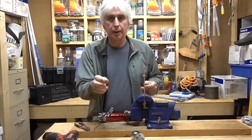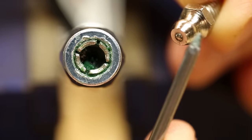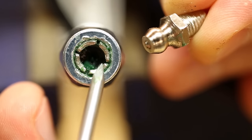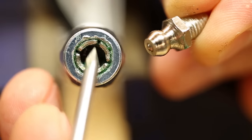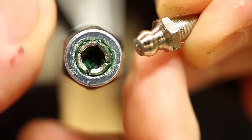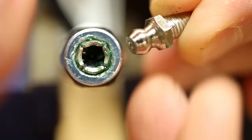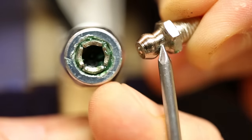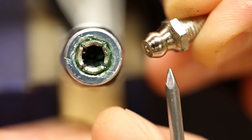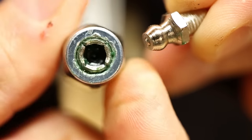Let's go ahead and put this in the vice and I'll show you a closeup of that. In this closeup, you can see that when you attach this grease gun to this fitting, the fitting has this little shoulder all the way around. The grease gun slides over it and into this area here. Notice how these are kind of spread out right now with a gap there. Well, when you screw this on there once you've placed it onto the fitting, watch those little gaps close up — that's basically causing those things to pinch down around this. Once it's clamped down on the fitting, you're hands free. You no longer have to hold this onto the fitting. You can use your hands to work the grease gun or do whatever you need to do, then come back, loosen it back up, and it will pull off of that fitting again.